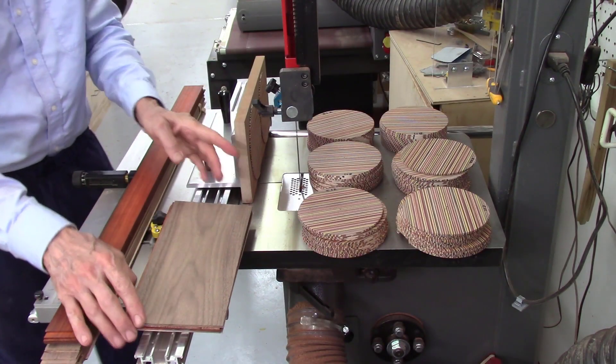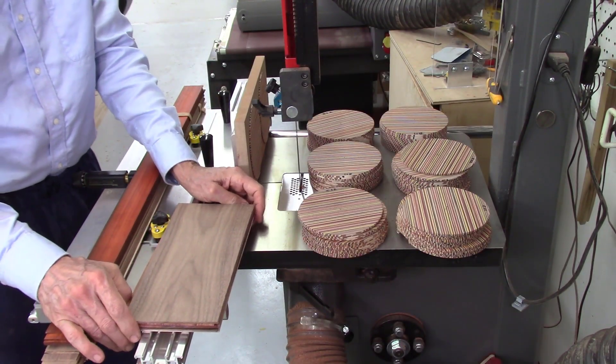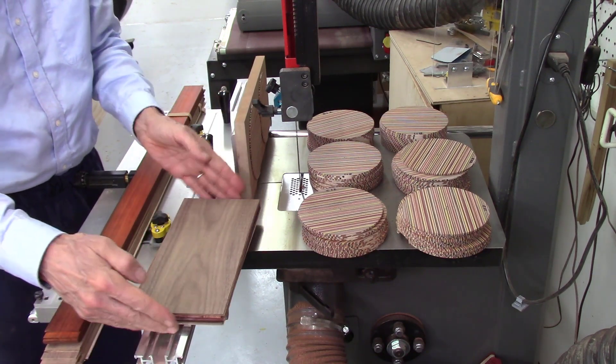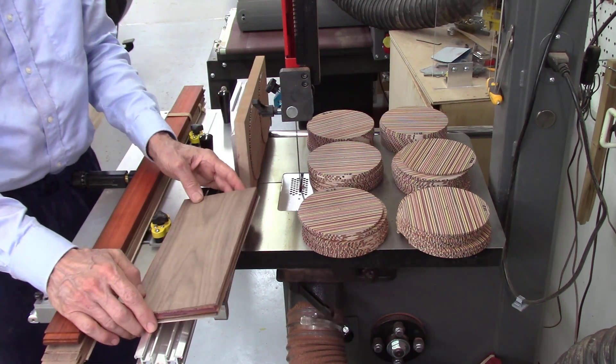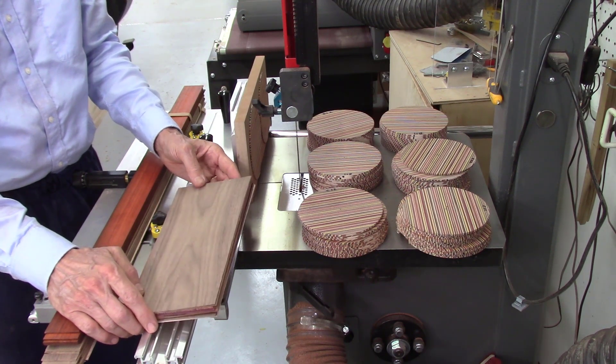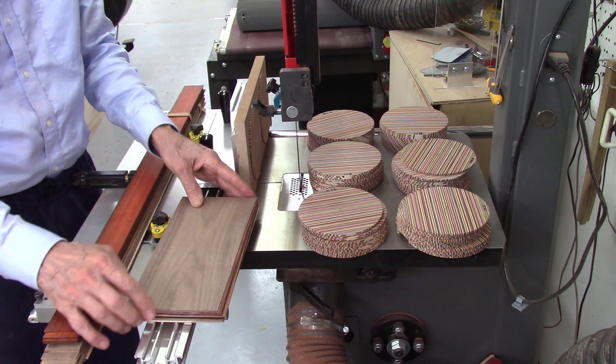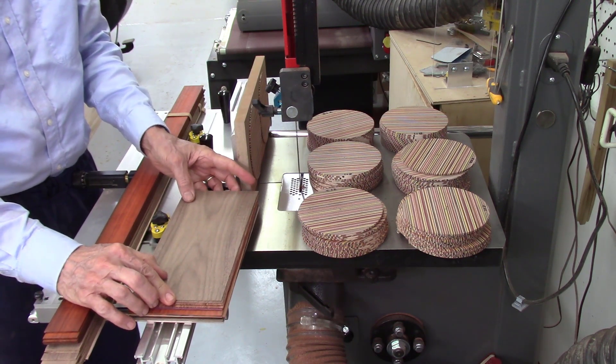When I was cutting boards for this Disney clock project I'm working on, these were about 5 and a half inches wide by almost a foot long. I used a 6 teeth per inch blade to cut these boards, and then I ran them through my board sander to get the saw marks out.